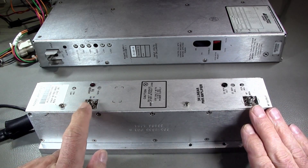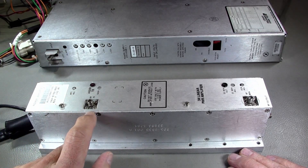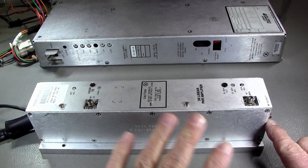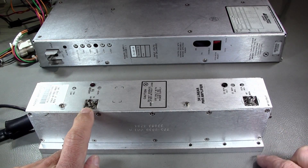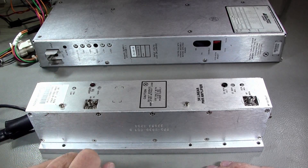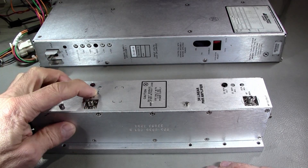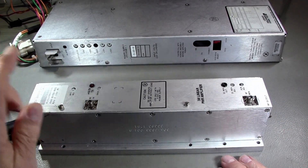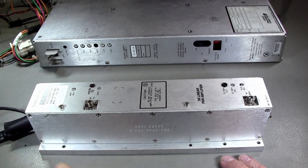So what's the performance? It's pretty good for my system because feeding it with minus 6 dBm coming from the W1GHZ transverter is enough to make it output 3 watts. Three watts is really the maximum it can put out — at that point it's no longer really linear, but at least 2 watts easy in a linear fashion. The transverter board put out a little bit more than 0 dBm, so here I need minus 6. There's a gain adjust right here, and I turned it down to make it put out 3 watts with the transverter. That saves me an extra amplifying stage between the transverter board and the amplifier — very cool. So there's plenty of gain.